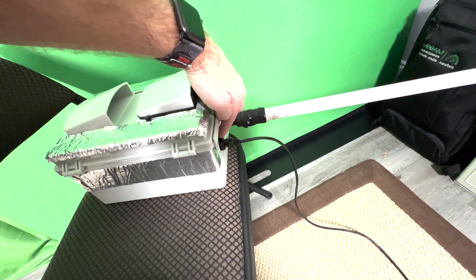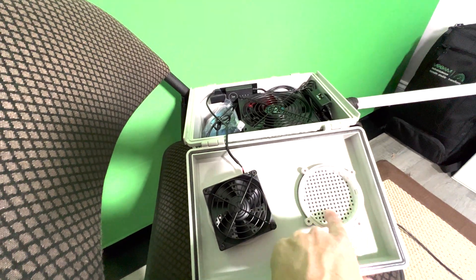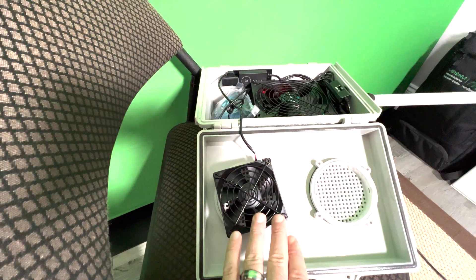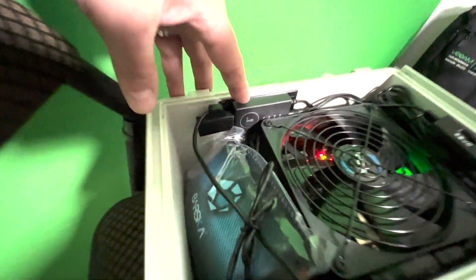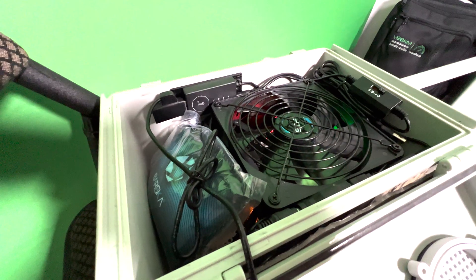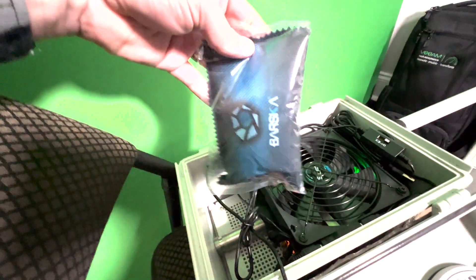Inside the box, on the opposite side of the vents they already have a screen to try to keep out insects. On the top vent I have an 80mm fan that exhausts hot air, but it's not running all the time. I actually have it on one of these temperature probes where you've got four different temperature levels and an actual sensor. Once it reaches a certain temperature inside the box it will kick on to exhaust any extra heat.